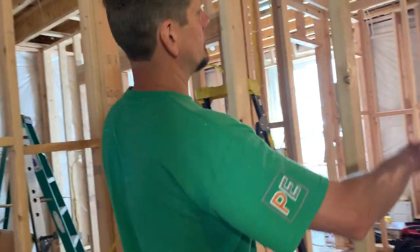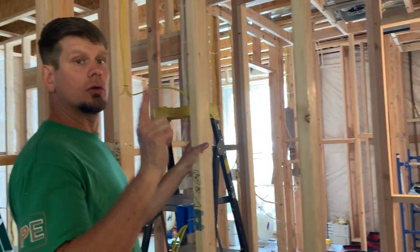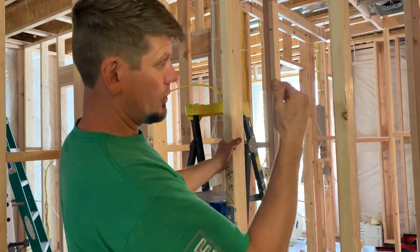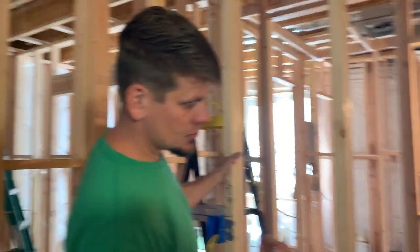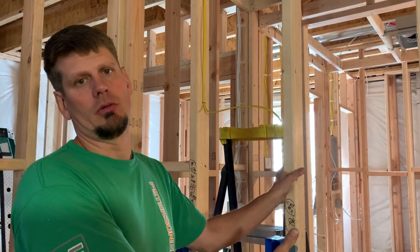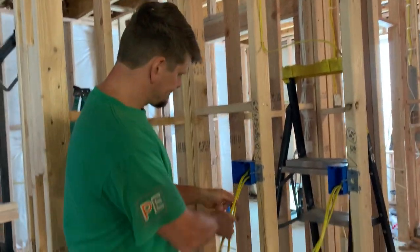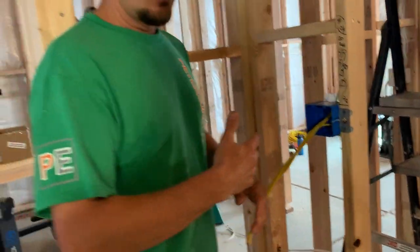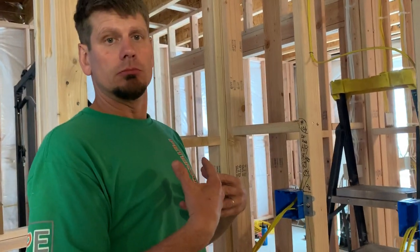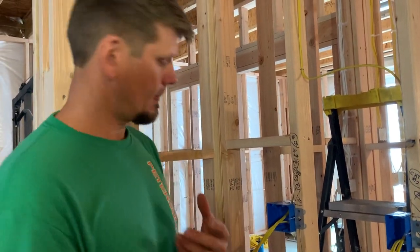He wanted to use the whole wall for the shower to put in his soaps. Look — if you're going to do that and go back to back to your kitchenette because your plumber likes the fact that the kitchenette is near your shower, put in a two-by-six wall. Make it simple and let everybody share that little space. Right here is circuit four. I went ahead and figured out all my circuits before I pulled them to make sure it all fits in the panel with full breaker spots for dual-function AFCIs and my quads and twins.